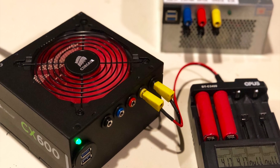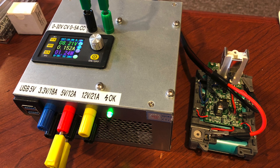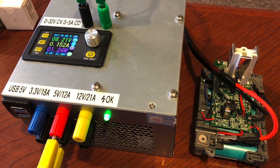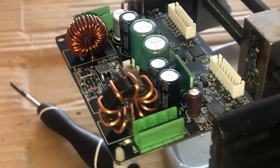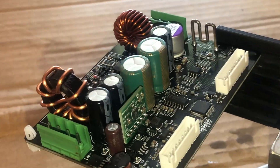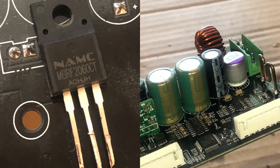The setup worked so well for me that when I came across a 600 watt power supply that just needed a new fan, I also went through similar steps and set it up for just dedicated higher current 12 volt duty, with no variable power supply added onto it. Using the variable power supply, eventually I connected the outputs backwards to an 18 volt battery. I could hear the pop and suddenly there was no more power output at all. So I took the buck-boost board out of the ATX case and looked all over for burned components, desoldered all sorts of things and tested them one by one, but I couldn't find any problem.